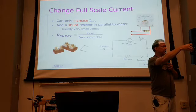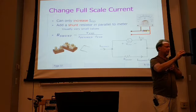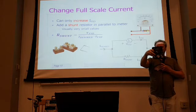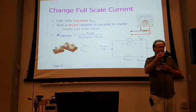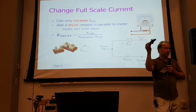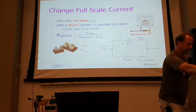That's actually the shunt for the 10 amp current range. And in manufacturing, when they built this thing, they would slide that back and forth along the shunt wire until they had the right amount of shunt resistance to get 10 amps. Because, like I said, it just winds up being a couple of milliohms of resistance, because we're shunting most of that current around the meter. So you can kind of see what that looks like. Pass that around.